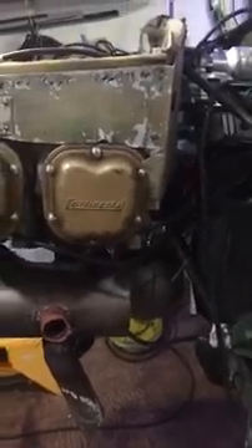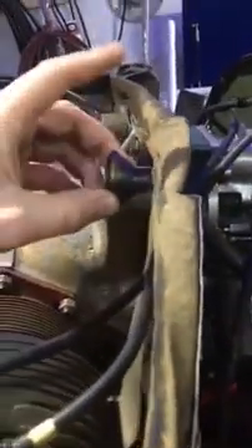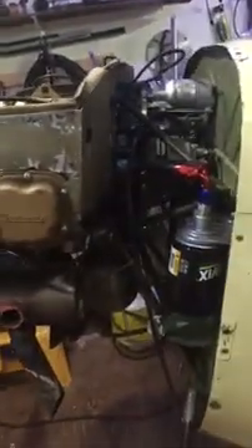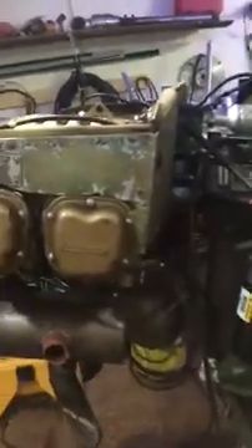There are a couple of things inherent to switching from the A-series engine — which is what that is — to the O200. One is the engine mounts. These are set up to use what I think they call Lord engine mounts. The O200 has got the big ones, but fortunately you can get bushings — I bought them on eBay. These old-style mounts fit in those bushings, so you can use your old mounts and it puts the engine where it's supposed to be, not further ahead or back. It works out. I'm going to have to get new bolts because those ones are a little long now.